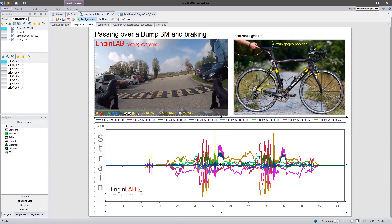Let us consider some strain gauges, in particular number one, two, seven and eight. Strain gauges number one and seven are sensitive to the pedaling action, but above all to the braking action, because the force between the wheel and the road surface acts like a bending moment at strain gauge number seven and in the zone with strain gauge number one. Strain gauge number two is on the side part of the bicycle, so it is sensitive to the torsion or twist action — lateral twist action — due to the pedaling action. Strain gauge number eight is sensitive to the vertical action of the cyclist on the handlebar.